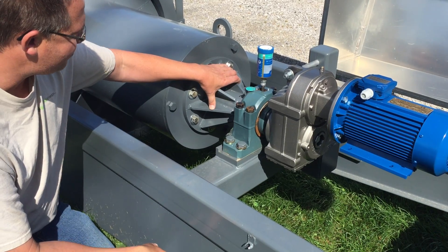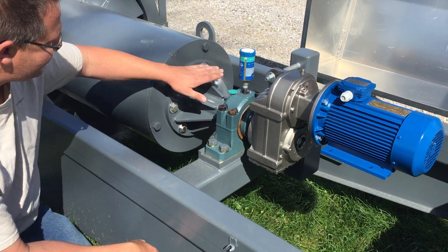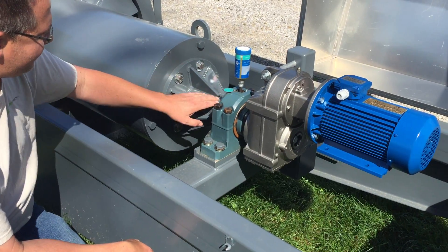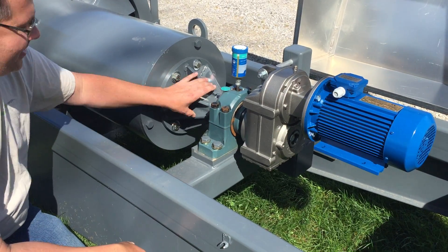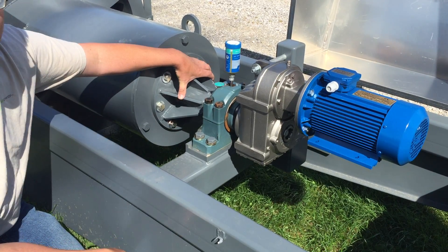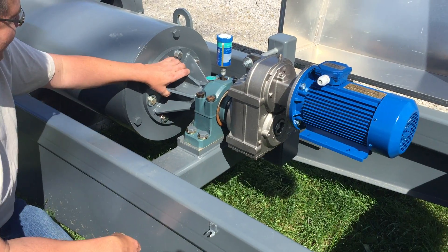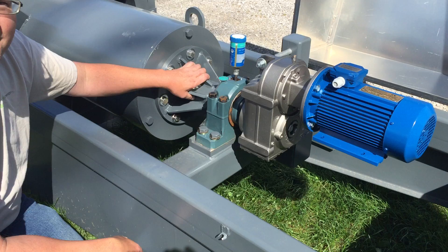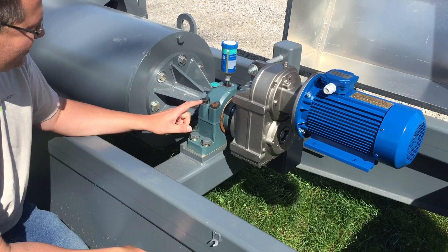This is a welded spindle — there are different options. You can have a complete welded spindle like this with gussets, a shaft and a plate, or this could be a forged where it's all one flange connected to the shaft. The design type is basically regulated by the size of the screw. On small screws we do this design; on large screws, like if this was a 200 kilowatt screw, this would have a forged flange on it rather than a welded spindle.